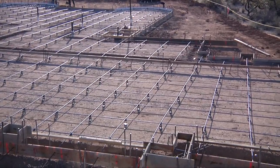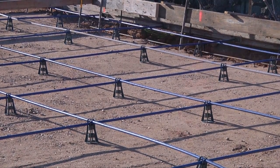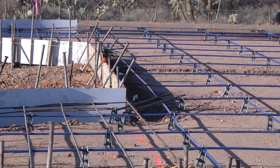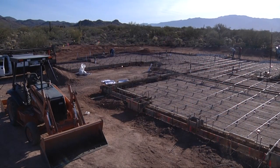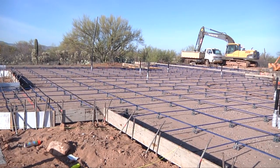We don't just do this on our own — we have engineers come out and inspect all along the way. Once the cables are put in, a company comes out and inspects the layout of the cables, the rebar, checks the lengths, and makes sure they're all in the exact spot where they're supposed to be. Then once the slab is poured, they witness the tensioning of the cables. We use independent testing as a double-check to make sure nothing is overlooked. That engineering company then certifies the slab, and that document is provided to the town of Marana — or whoever the inspecting jurisdiction is.